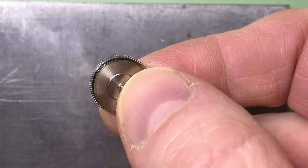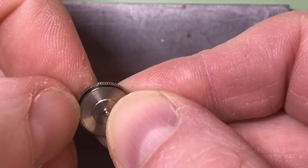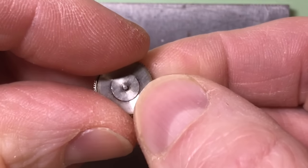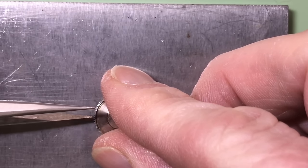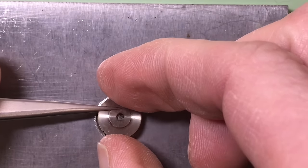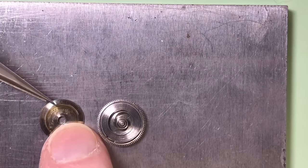Try not to push down on the top — and that has already opened. You can see the lid is off now. What you don't want is it springing out, so make sure you've got something to protect your eyes. The bit you can see at the top is part of the arbor, which goes straight through the mainspring itself. Sometimes it's easier just to lay them down. There we are — the barrel is off, and you can see on this particular one that the barrel lid is quite worn.